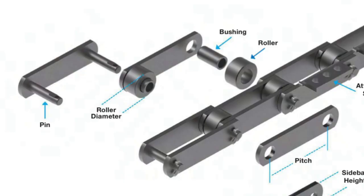One of the advantages of straight link chain is that they can lift a little bit more weight because they're solid, but the numbers are really, it's mathematical. The difference is minor, honestly. So they can lift a little bit more weight, but the deal is that there is hardly any stretch to them, because it's simply the wear of the mechanical components along the way that causes the stretch.